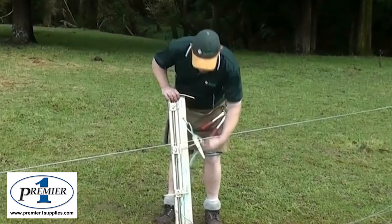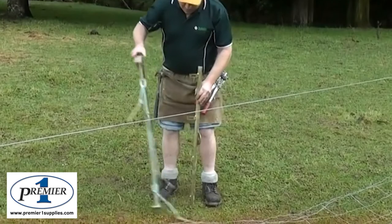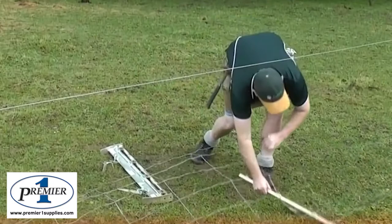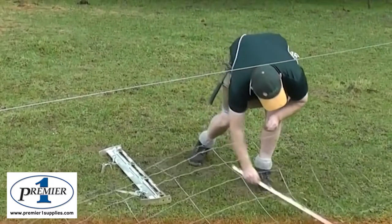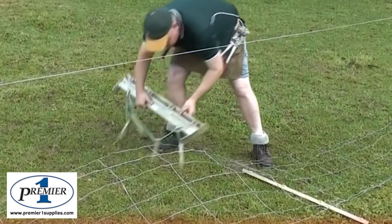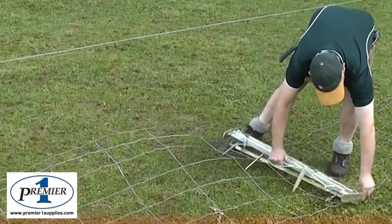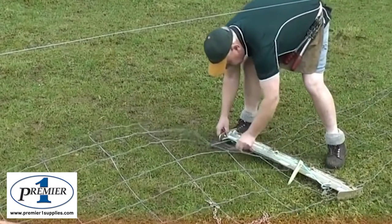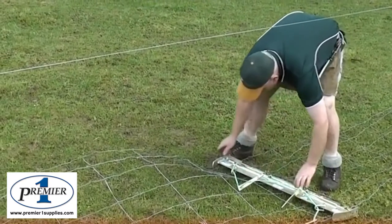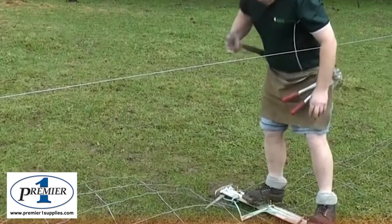Using the netting strainer boards, pull the edges out, put the bit out of the back, place it under the netting. It's got this round bit on here, so keep some plugs pointing upwards and sit the clamp back on top. Put it in the right position, just stand on it and that bends the netting down a bit, then keep standing on it while you put the wedges in.